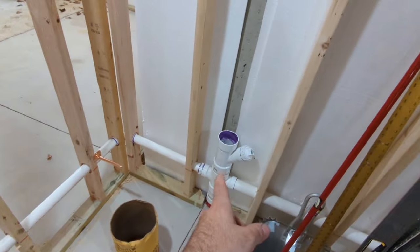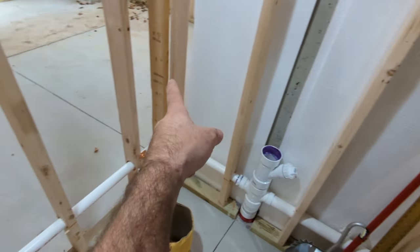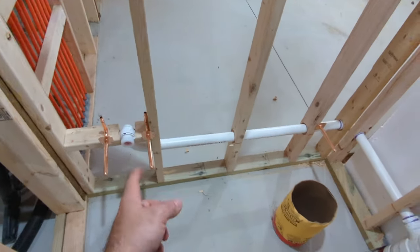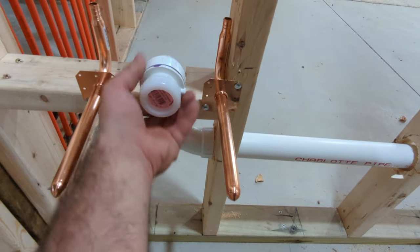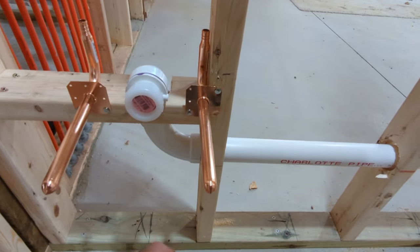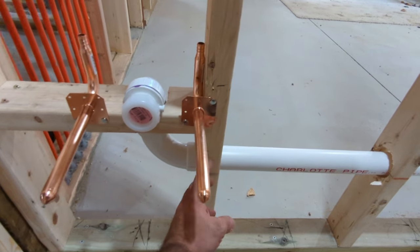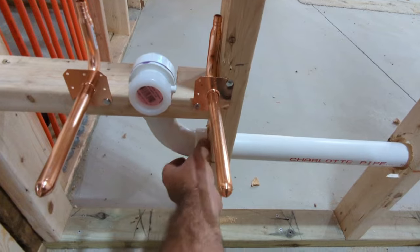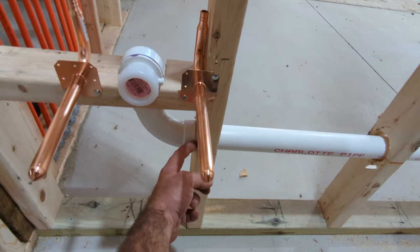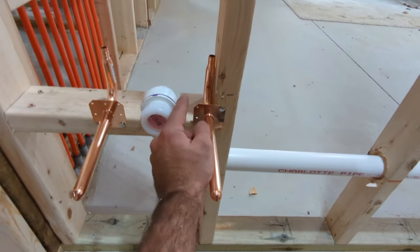No big deal again here. We'll have a reducing sanitary tee here. We'll go back around the corner and go down into it. So it just means I've got to cut this off. These two elbows and the nut have been welded. I'll have to chuck them. It's, you know, $15 worth of stuff or less. I'll have to change this block so the notch is a little bit to the right, because the new elbow will have to slide onto what's left of a piece of pipe here. But we'll go through a sanitary tee.